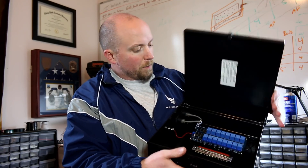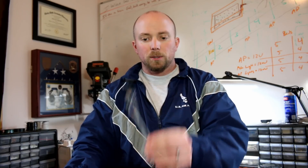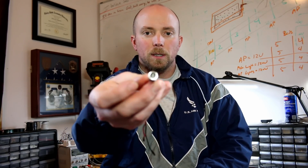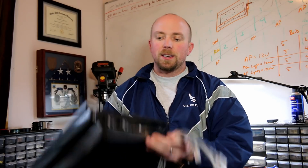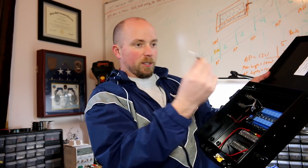The relay has main power coming in and it's daisy chained all the way around the neutral bus bar and the ground bus bar for 120 volt power. For the computer box we've got signal one and signal two cables — RJ45 connector, Cat6 cable, with pin outs that go into the Arduino. We have the 12 volt power supply, and then I realized I have six more cables to build because I forgot the cables that connect S1 and S2 — luckily those are just Cat cables. All right, now everything's done; these cables connect this box through the signals to the computer box. We have the power cable, signals for the other side, and DC power. Let's go out and install this thing.